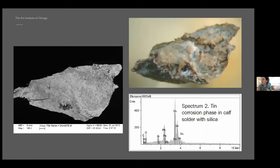While complaining about the lead on the interior, we did find bits of lead on the exterior — such as on the underside of the proper right foot — and samples appeared to be lead remaining from antiquity. Samples like these were also analyzed and found to have an overwhelming percentage of tin. This composition holds out an extremely interesting possibility: the melting point of tin is extremely low, far lower than lead, and once molten the tin stays pliable for an extremely long time and can be worked with soft tools, even a damp piece of wood. So the lower melting point reduces the difficulty of placing molten metal inside a large and cumbersome sculpture, since heat enough to melt the solder could more easily be applied to the exterior of the bronze.